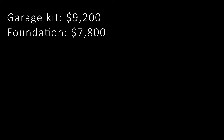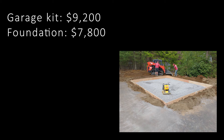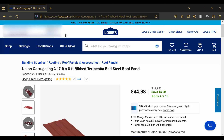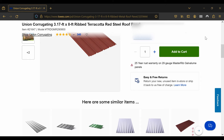The next big purchase was the concrete foundation, which ended up costing $7,800 including the labor to pour it. Note that with this garage kit the foundation is not included and using a concrete foundation is optional. You can save money by using a wooden foundation, but you'll miss out on durability. The roofing materials are also not included in the kit, and in total the roofing materials cost around $2,000 for me. I used metal roofing panels and trim pieces from Union Corrugated, available at Lowe's or Home Depot under a different brand. You can also use asphalt shingles to save some money.